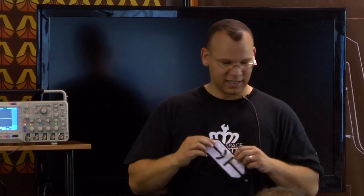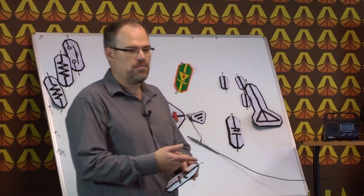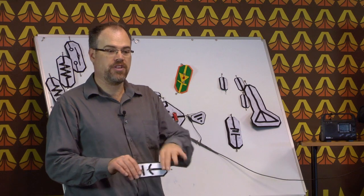So hang on a second. The schematic symbols, just to help you understand, this is a capacitor. The wire doesn't go straight through like it does on some of these shorts and things. It stops, right? And physically what it actually is in there, there's a metal plate, usually metal or something very similar, and there's another one like this. And so it gets really close. It's like if you're trying to plug in a tool in the garage and the cord's just not long enough, it gets close, but you don't connect. So electricity can't flow. So one of those plates can feel the electricity on the other side, but the electricity actually can't cross if it just stays there. It can feel it, and it wants to move, but it can only go so far, and then it just can't physically go. But if you switch it, it can keep feeling it. And so that's why you're not going to leak electricity across the capacitor. Whatever happens on this side happens on this side, but it doesn't actually flow through. So if we fill this one up, this one gets excited. If we empty this one, this one feels empty.